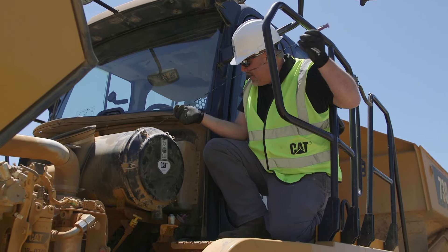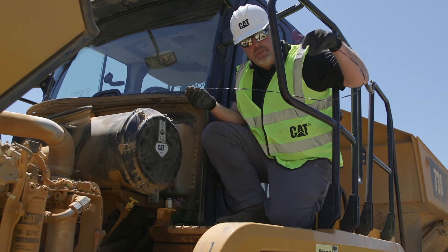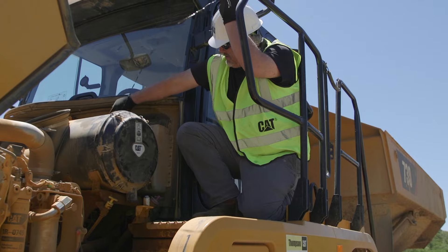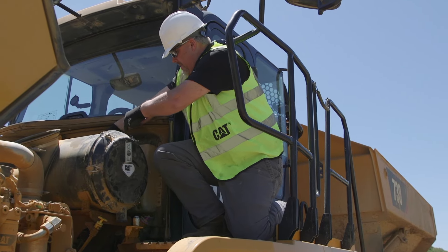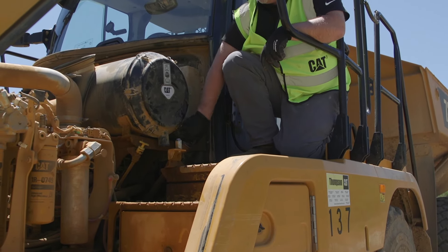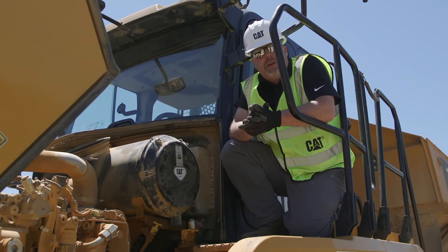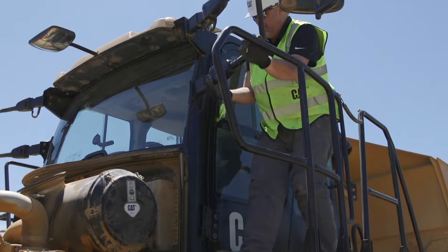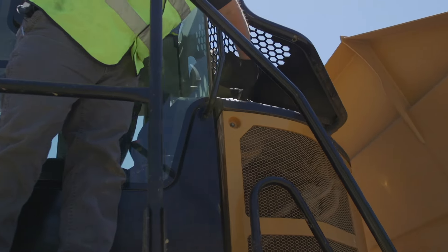As I finish up, at the top we've got our dipstick for our transmission — it's color-coded purple, just like all the Cat fluids are color-coded for the type of fluid. I've also got my transmission fill cap right there if I have to fill up with transmission fluid. Engine fill is on top of the engine block. Just checking everything out inside the engine compartment, making sure there's nothing out of the ordinary before I close the hood. And as I come back to close the hood, a quick turnaround — my coolant check is the sight glass right inside here, and I've got my coolant fill right on top.